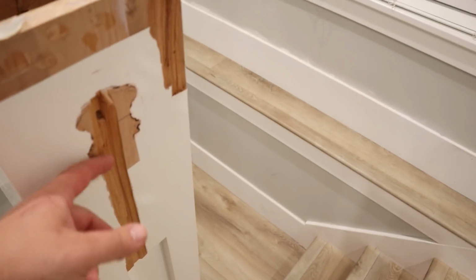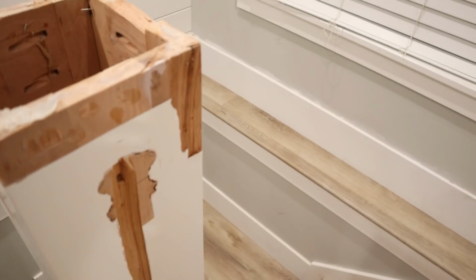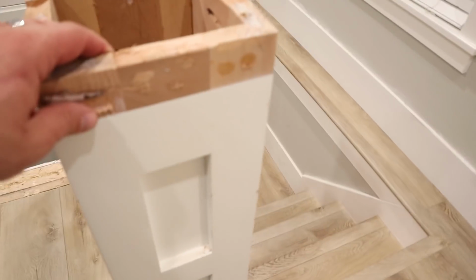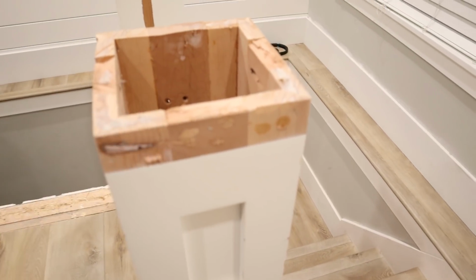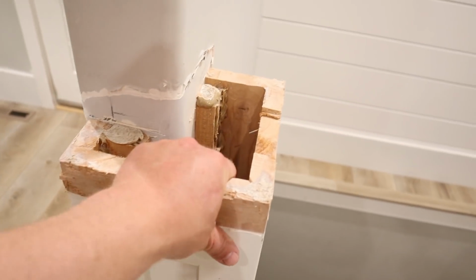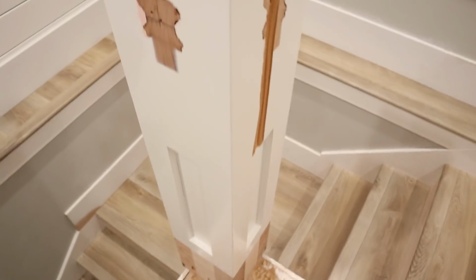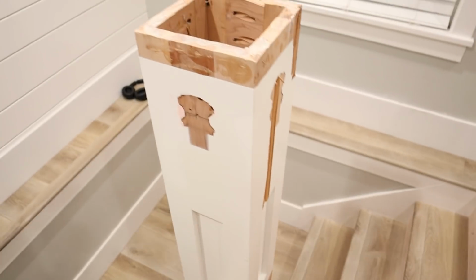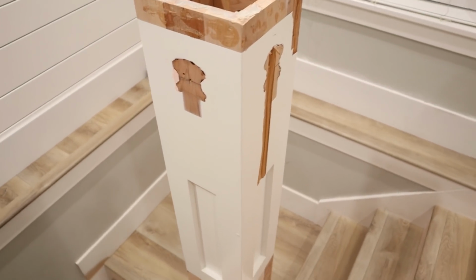All right, we got our mess cleaned up. I had a couple disasters though. We had some wood that broke out at this section right here, some on the corner. Gonna have to get those two pieces fixed. You gotta sturdy some of these up. This one here is a little shaky. The boys have been hard on that one. The other two are pretty solid, but we're gonna put some screws back in them just to be sure. This one here is rock solid because you got this wall to tie into. It's these others that are in the open. You have to have these blocks that go inside. As you can see down inside there, there's some wood. You have to secure those to the ground and then slide the actual newel post over those. So that's where it gets its strength from.